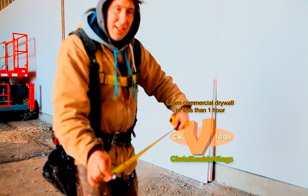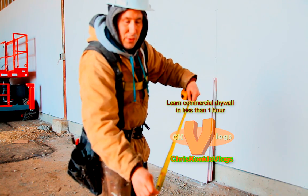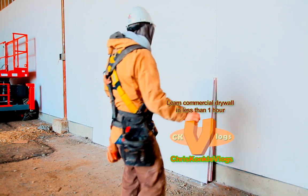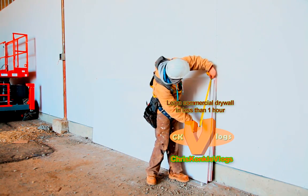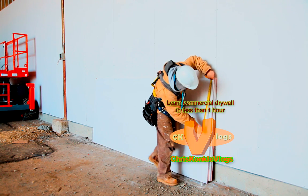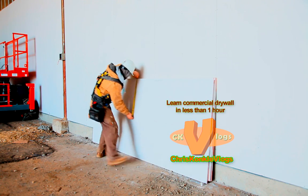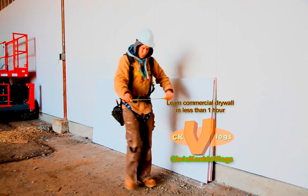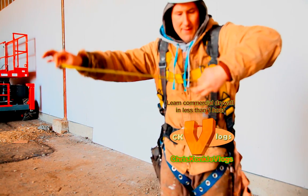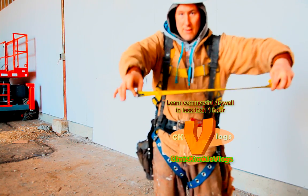If you're marking 16-inch centers, you wanna go to 15 3/4 and then 31 3/4. That'll give you your 16-32. Simple as this. Okay, using your thumb and your pointing finger again. Set it at 23 3/4 and then sidestep. Hang on for dear life. See this? It's going nowhere. It's very, very strong. So you can see how I've pinched it like this. Okay? Very, very good, solid, strong grip.